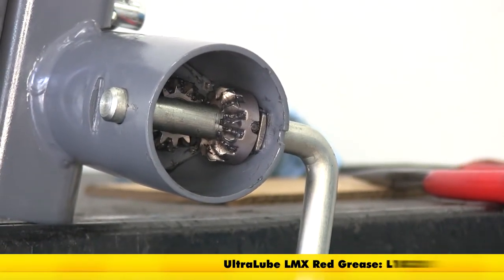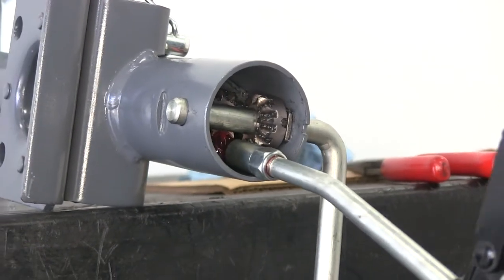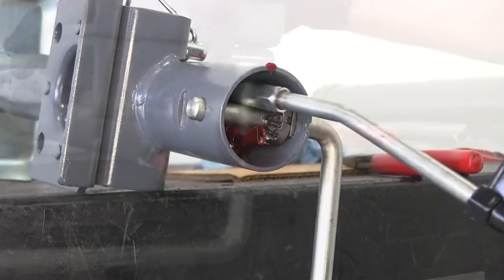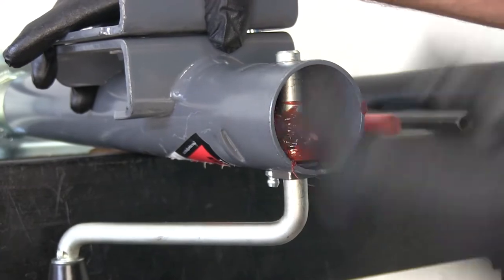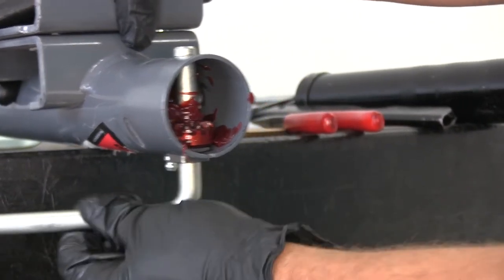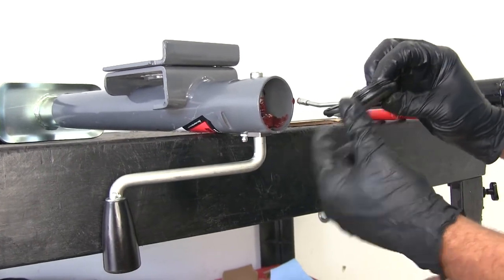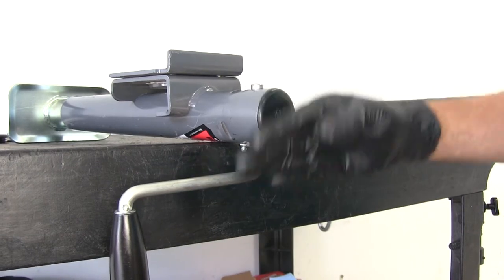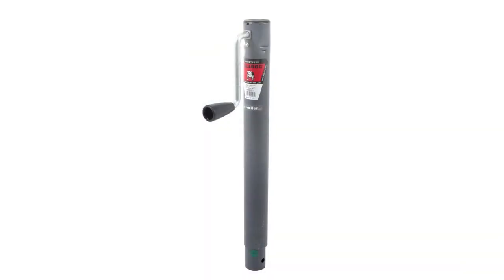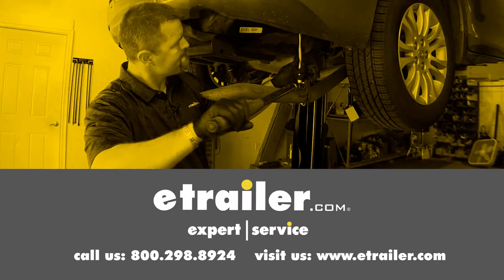Right back together. Now we'll want to use a good quality grease — it doesn't have to be a high temp grease or anything like that — and we're going to go in there and make sure we get this fully lubricated. We're right back to brand new, and we'll have great smooth operation, making our trailer very easy to lift and lower with all of our new components and fresh grease. The replacement cap has a little notch; I like to line that up with the notch in the tube of the jack itself, and that just taps on pretty quick and easy. That completes our rebuild of the Bulldog 150 series jacks. With a few parts and a few tools you can really save yourself a lot of money as opposed to buying a brand new jack. Click the link below to shop, learn more, or visit us at eTrailer.com.